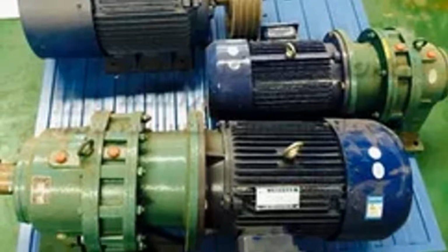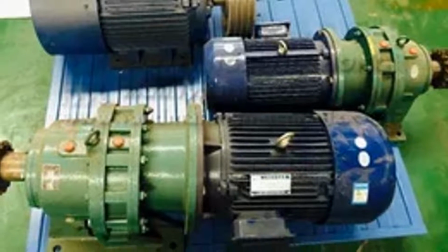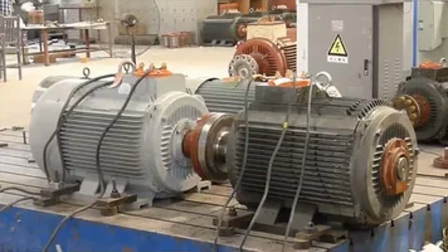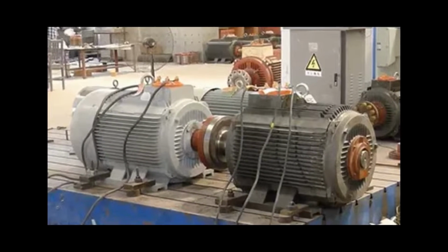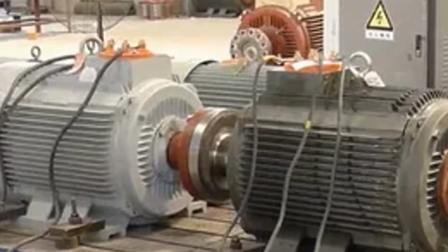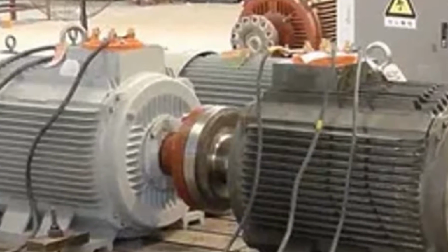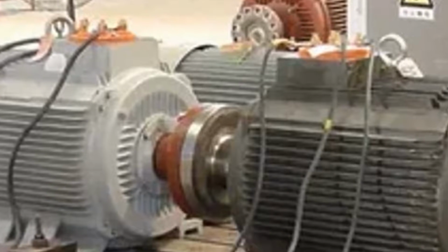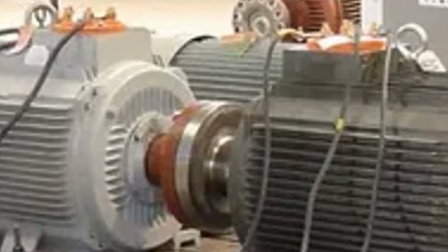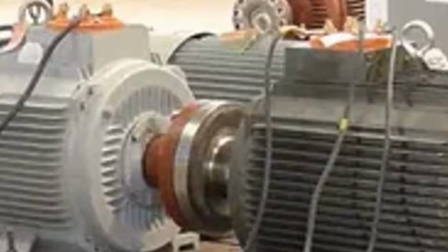The power factor of the stator electrical input can be directly controlled by adjustment of the field current. If the field current is increased beyond the value required to provide the magnetic field, the stator current changes to include a component to compensate for this overmagnetization. The result will be a total stator current that leads the stator voltage in phase, thus providing to the power system reactive volt-amperes needed to magnetize other apparatuses connected to the system such as transformers and induction motors.